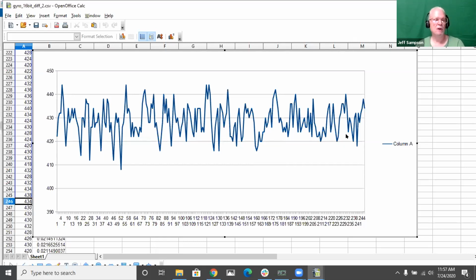And then when you're all done with that, you go through a calibration step and you say, with it at 0, you turn it 90 degrees and you get a number like 535,000 or something. So you divide that by the 90 degrees, give you counts per degree. So now you have a scale factor. So now you can put it on the table, you can turn it back and forth. And you go to 0 and it says 0, you go to 90, it says 90.